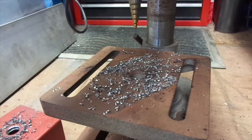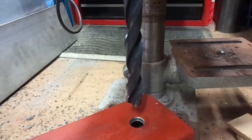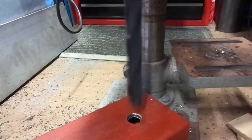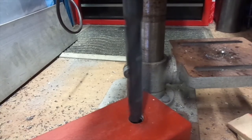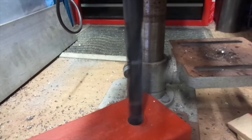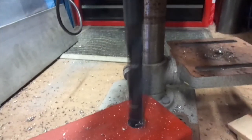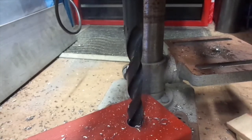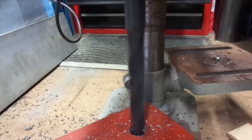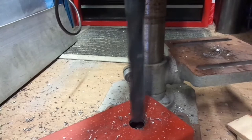Plan B: 20mm drill, cutting fluid. Let's see if we can finish this hole. I kept the pressure constant. As you break through you get a large burr on the bottom and I should release the pressure as I feel it breaking through, but I'd forgotten about that. It's been a few years, but there you go.